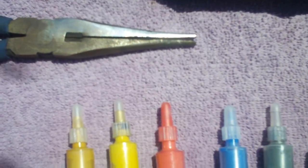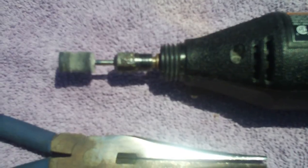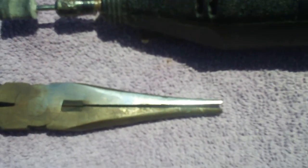Basically what I did was I took a high-speed craft tool and put a small buffing wheel on it, and buffed this out in three different grits — I used 10, 2.5, and 1 — and it only took me probably about three or four minutes to get that little bit of metal there.